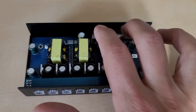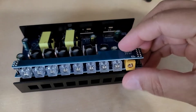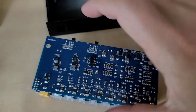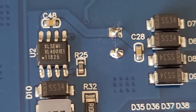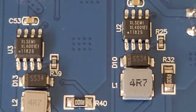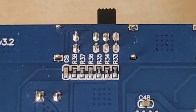For those two adjustable outputs, if we take it apart and look at the other side of this board — it's quite complex. The way they're doing it for these switches, they're using a very simple and common buck converter — a DC-to-DC buck converter. There are two of them here, and that's how they're basically taking the 18 volts of isolated power and adjusting it down to whatever voltage those switches are set to.